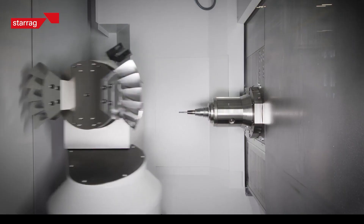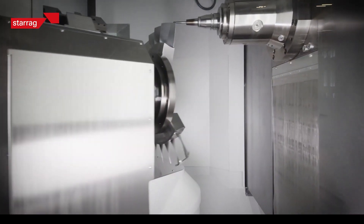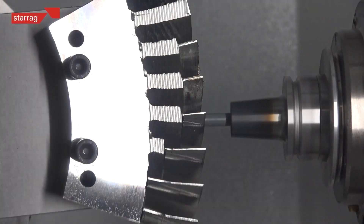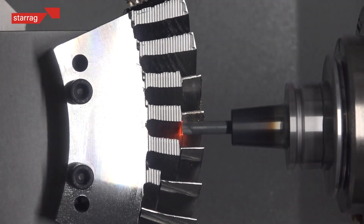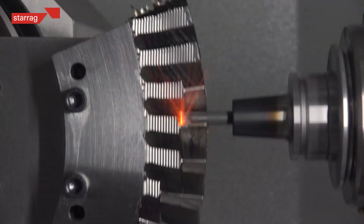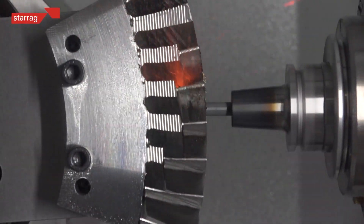Does that mean it's a fast machine? It's viciously fast. And what kind of materials would you be cutting? What kind of Blisk materials? Well, there are two types of materials predominantly: titanium alloys and nickel alloys, usually an Inconel type material. They're both cut in different ways but the way the machines are built, the characteristics are such that they cover the ranges for both material types.